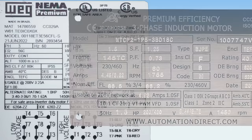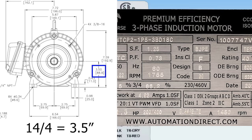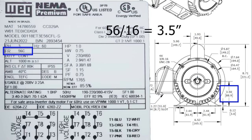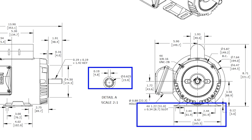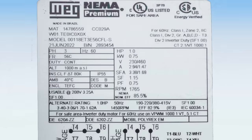Then we have frame. Frame specifications are standard across all NEMA motors and tell a great deal about some physical attributes of the motor. If the frame number has three digits like this one, we can take the first two digits and divide by four to determine the height from the base to the center of the shaft in inches. If the frame has two digits, like say a 56 frame motor, we divide those two numbers by 16 to get the shaft center height. So if you see a 182 and a 184 motor, the shaft center height is the same on both since we only consider the first two digits. These frame numbers also specify the mounting dimensions and shaft size, but there's no neat trick to determine those — you have to look those up in the specs or a reference chart. What that means is you know that the same frame motor from any number of manufacturers will have the same mounting dimensions and shaft diameter.